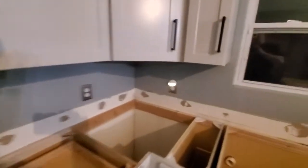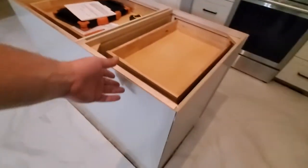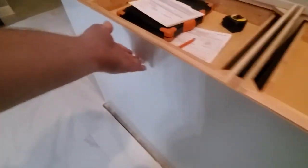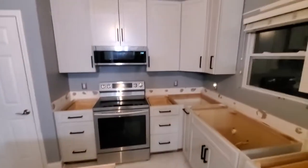I would say, in the future if we can, a 2x4 per job for things like this. Also things that might not be thought about. When we skin the back of these, they're kind of hollow in here a little bit. So we put a 1/2 inch piece of 2x4 down, a couple of them, so we can shoot and glue into them, so that way this isn't flimsy and flabby. One 2x4 per job would be a good idea.